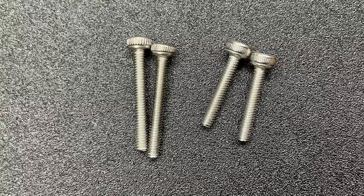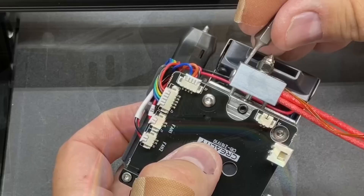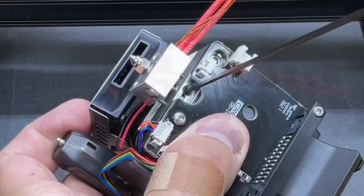The reason I set aside the old screws is because they're longer than the ones that come in the kit. The ones in the kit are actually too short — I can barely get a thread started on them, so I'm going to use the old screws instead. This sits tight against the PTFE tubing inside. I'll tighten these two screws by hand and then tighten the grub screw next, and this will hold it all in place.